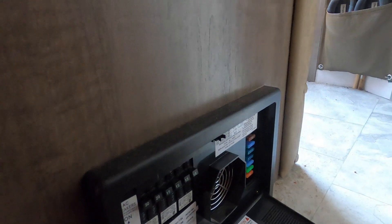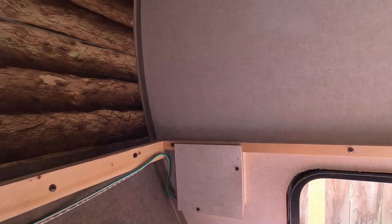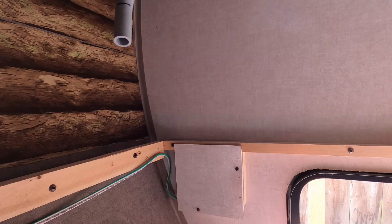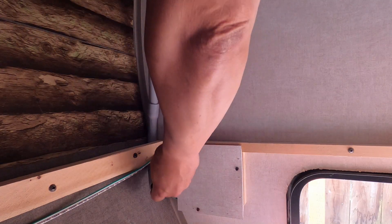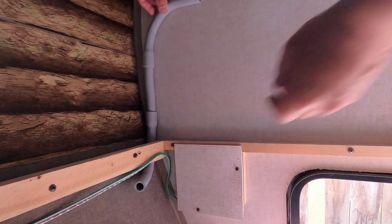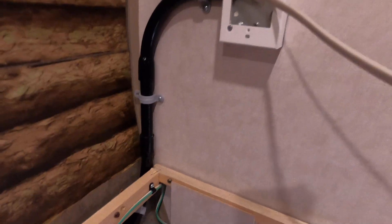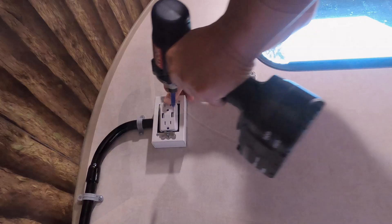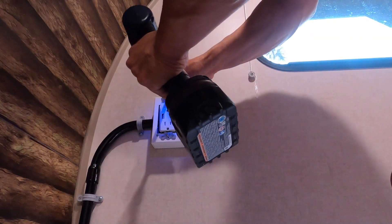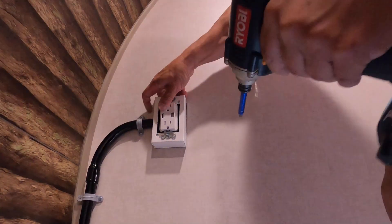We're getting to the goal line. First, be sure to turn the main breaker off again so we can make the final connections. I picked up some plastic electrical conduit from the hardware store and fit it into place, making sure I was accounting for the height of the mattress. Once I had all of that marked out, I mounted a wire mold box to the wall, painted the conduit, and ran the wire through before securing it all into place. Connect up your new outlet, remembering that black-on-brass bit. Note that I got an outlet that also contains two USB ports.